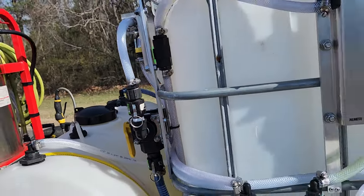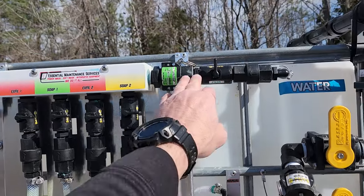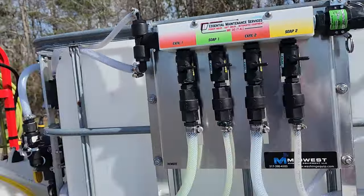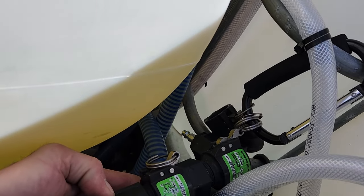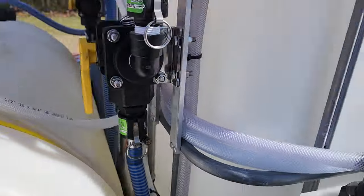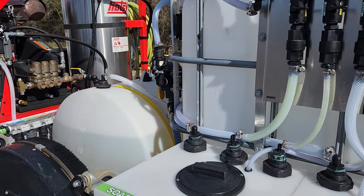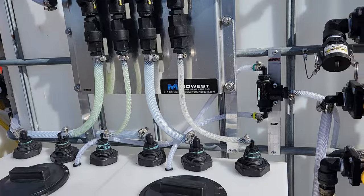Everything run off of these modules is activated down there with the exception of this, which has a transfer switch. This here is a manual control — it runs your soaps for your downstream. And then this is a flush valve. This flush valve will flush out this entire system. I have fittings I keep here — double-ended males and double-ended female adapters. This cams off anything up here that may need to be cammed. It has an air fitting on it and you can plug that on in place of this, hook it to your compressor and winterize this entire system from this one point. Then you winterize the other side at another point — I'll go over that in a minute.